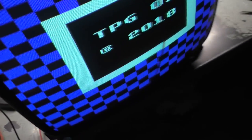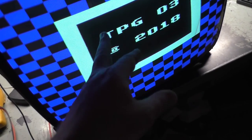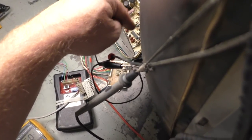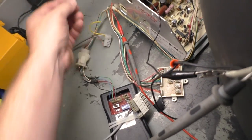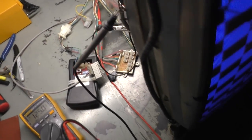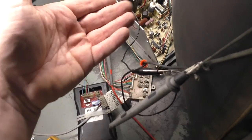I'm curious as hell right now. But we do have a functional chassis now, so the entire problem with this, and we're still dead on 125. Awesome. The whole problem with this was that H frequency pot, I think, being out of whack and our faulty IC101 switch mode power supply chip. So I'm assuming, I never powered it up fully with all the original caps, but I'm sure it worked fine. So let me get the flyback changed out, and we'll give this another try and see if that is caused by the flyback.